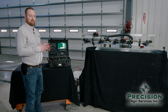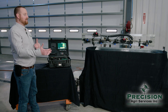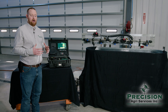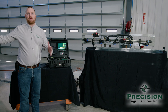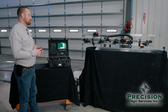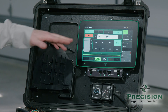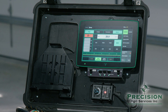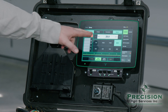The other thing with the Symphony Nozzle System is on the rate control side — it gives you the flexibility to run different rate sections. Most people have a lot more weed presence around the outside of their fields, so when they come in to spray, they want to be able to increase the rate of their herbicide product for better weed control. Right now it's set up as a single rate — the whole sprayer spraying at 20 gallons per acre. When you take the sprayer and start turning, the system will slow down and speed up to get the exact rate per nozzle across the system.